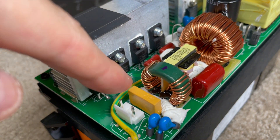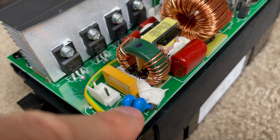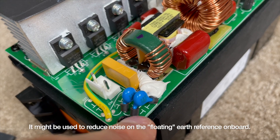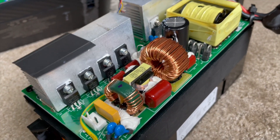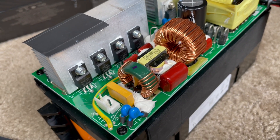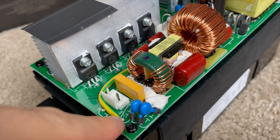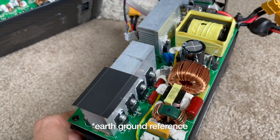There's also an X cap and two Y caps with ferrite beads — really good attention to detail. What's interesting is this whole output is floating — there's no earth reference at all. Not even the input charging plug is referenced to earth; the DC barrel jack is just a polarized plug. There is a ground wire that snakes all the way back to the input, but I'm not sure what it's doing without an earth reference. If you guys know, let me know — it's different from some of the higher-output units.